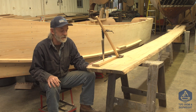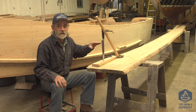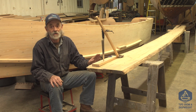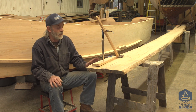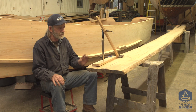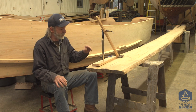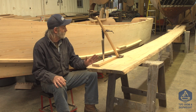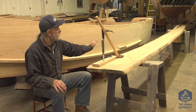What makes this piece different is that it's a swept log - not a nice straight log. You could go into a mill and find a log like this pretty easily because you can't cut a ton of lumber out of it for most people's purposes. Not nice straight lumber, but I'm not looking for nice straight lumber. I'm looking for nice swept lumber just like this, where I can cut rails and different pieces right down the sides of it just as nice as can be. Quarter sawn deck timbers and stuff all come out of the funniest pieces of wood - this being one of them right here.